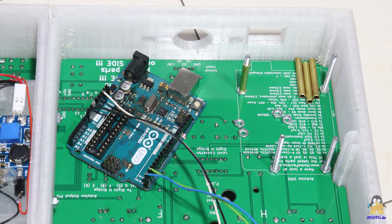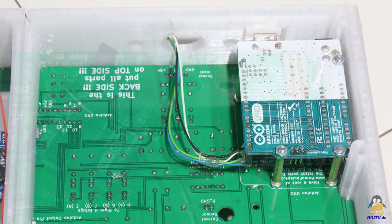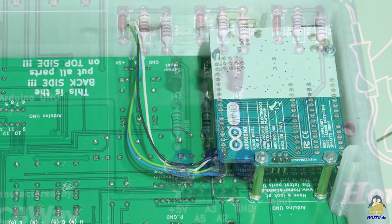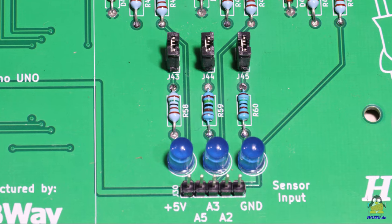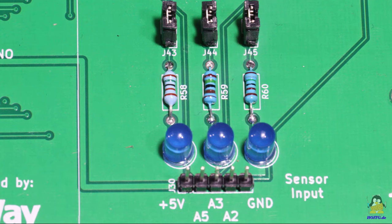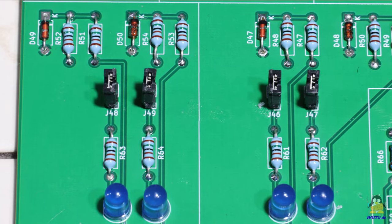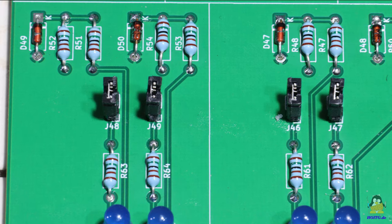The Arduino Uno board, which is required for programming the motor driver, now has a permanent place on the underside of the board — 4 more holes were needed for this. The pins used as control inputs for the dual H bridge have also received upgrades. LEDs now indicate whether a high or a low signal is present. Furthermore, resistors and Zener diodes ensure that no voltages higher than 5V are forwarded to the microcontroller.